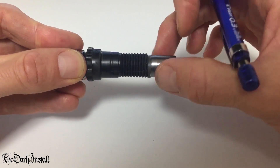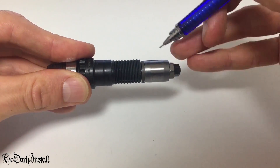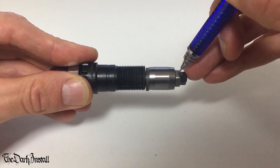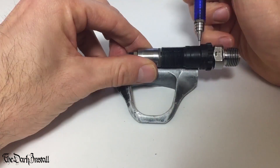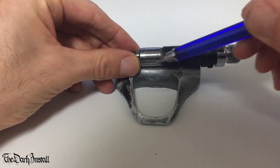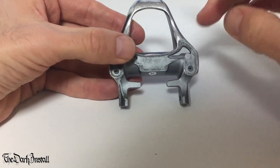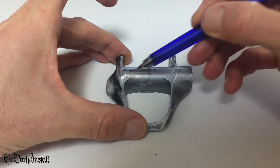This sits into the pedal body and this part is essentially press fit into the pedal body, so it stays in position and then the axle turns around. There's a row of ball bearings here and a row of ball bearings here - these are essentially angular contact bearings, and the races are formed by the inside of this part, machining on the axle, and also this part of the locking mechanism. This part sits into the pedal body and stops there - that line is what stops against this bit. The bearing arrangement is actually sitting here on the pedal body. Bearings attach to your bike here, which is good engineering because if the bearings were sitting further out, the end would have no support. This is the optimum position for the bearings to sit.